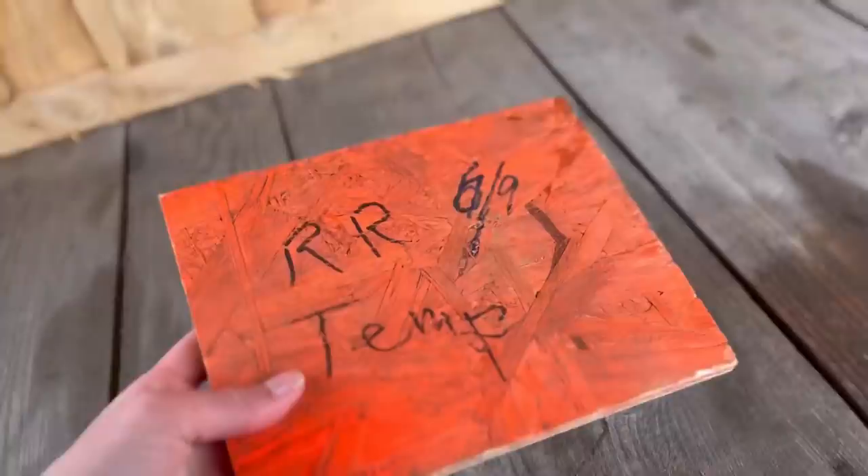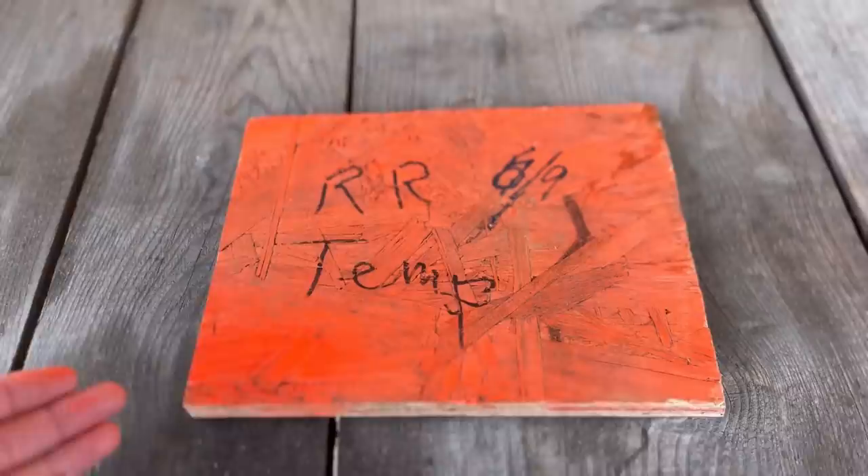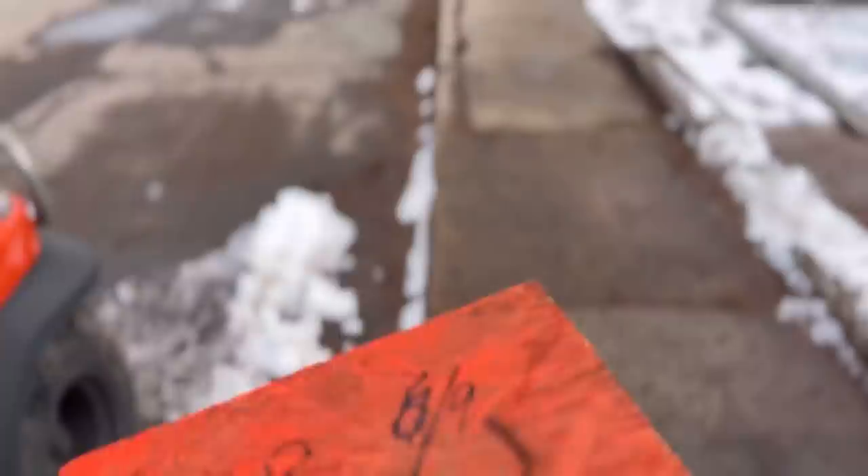What we did was we actually made a little railroad template. The railroad ties that we cut are a 7x9, so this way we can just kind of trace around the edges of it to act as a visual aid when cutting the railroad tie. It has been challenging in the past to figure out how large to cut the first slab when you have a very small log, because you can have a log that is large enough to get your 7x9 cant out of, but one miscut and the whole log is trashed. So Grandpa made this visual aid for us so that we can know how large to cut the slabs and how much we can take off and still be safe.